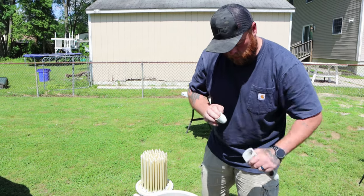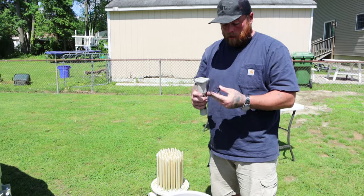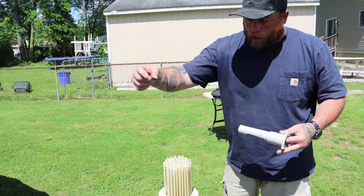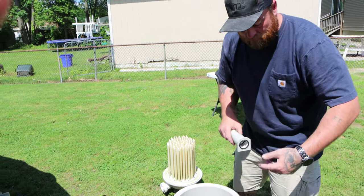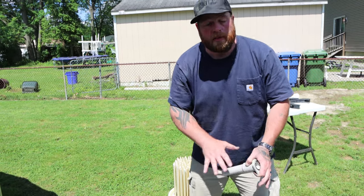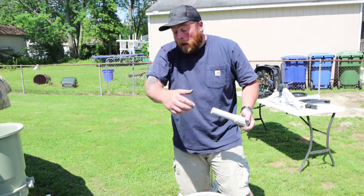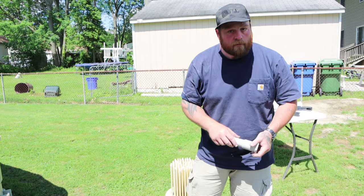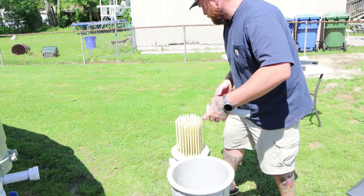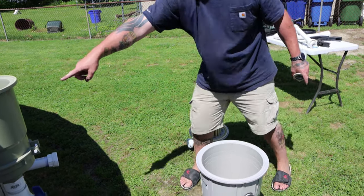There's a little notch in here that you've got to line up. Pop that retainer clip back in, this part facing down. Because what it is — it's letting the water come in from the skimmer, it's coming back through the basket, in through the pump. The pump is forcing it into the filter, which is passing through this check valve, coming down and shooting down, which is where all the diatomaceous earth — that four pounds of diatomaceous earth — lays right in the bottom. What it's doing is, any particulates that shouldn't be in there, algae, whatever — the diatomaceous earth is so fine, it's like ginsu knives, it just chops it up. Then it pushes everything up through these filters and this filter media. There's hard plastic inside here, and it goes up, back out to the return eye, back to the pool.